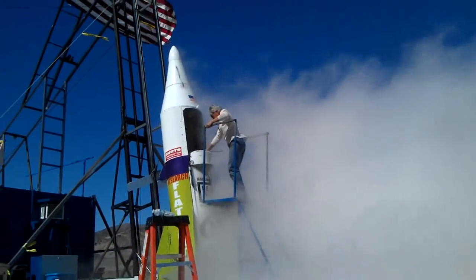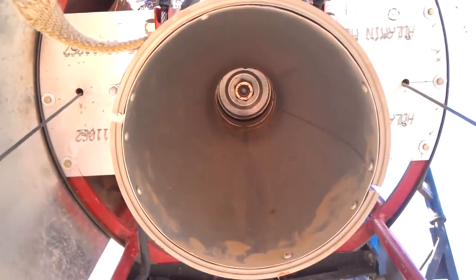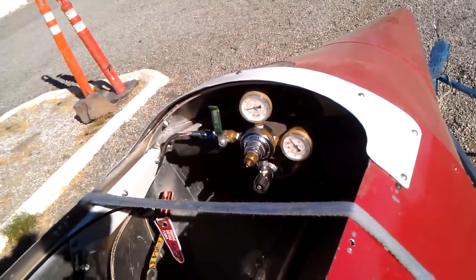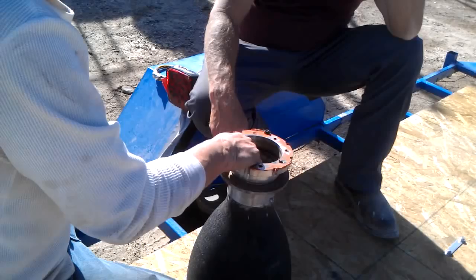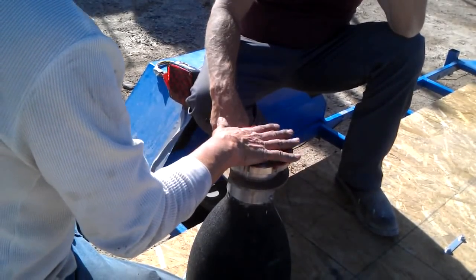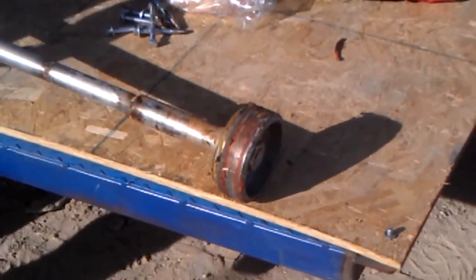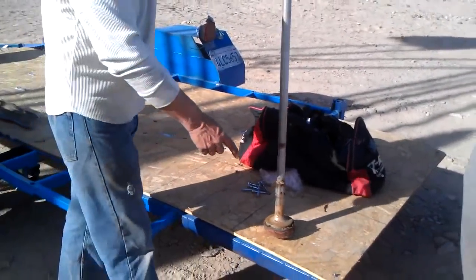But it's enough to create as much thrust as they do. At the entrance to the nozzle you're at 400-plus degrees; by the time you get out you're down to the local ambient boiling point — 212°F — so it drops that much temperature over that distance. Where the temperature goes is the heat of vaporization; it takes a lot of heat to turn water from the liquid state to the vapor state. That's the thermodynamics behind it, and it just tickles me — I think it's so awesome.